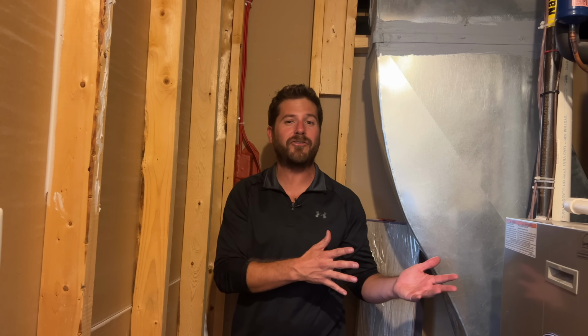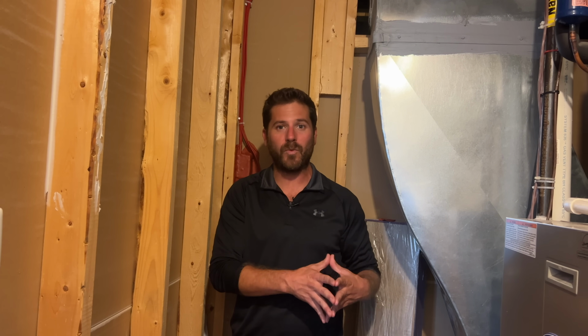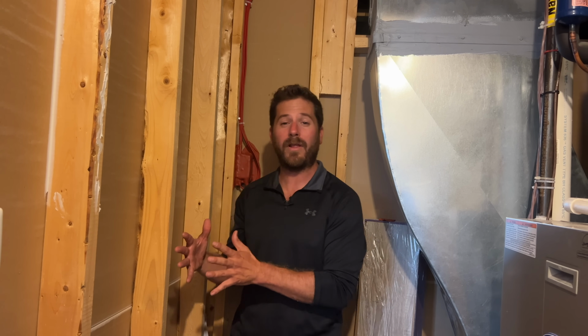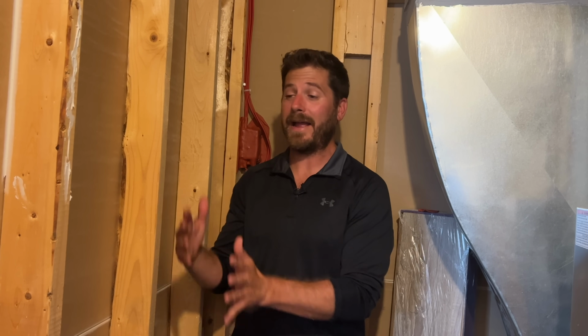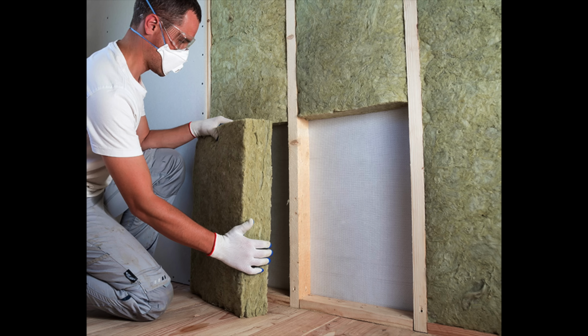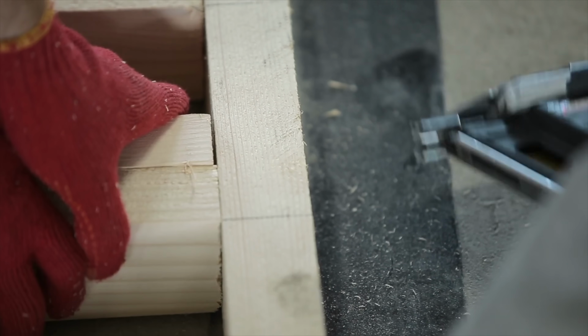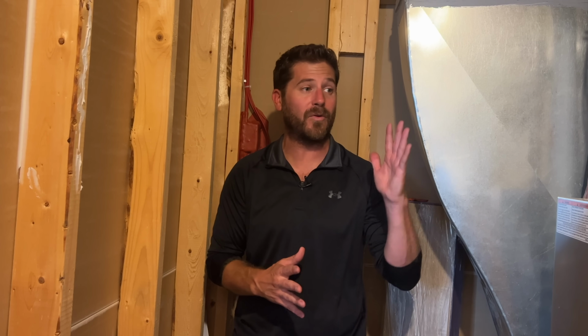And that's why I mentioned if you live by a train track, because as you would know, a train would have a lot of vibrational noise. You don't only hear it, but you feel it. And that's what that air gap will help reduce, that vibration. By building another wall and by basically soundproofing the first and second wall, you'll be well on your way to basically not hearing anything through the room or from outside if you have noisy neighbors or a train.